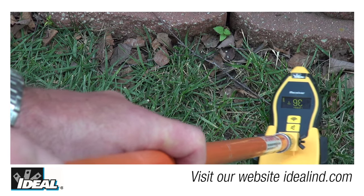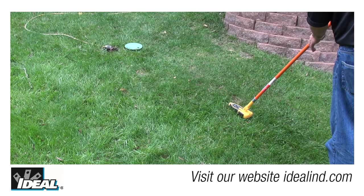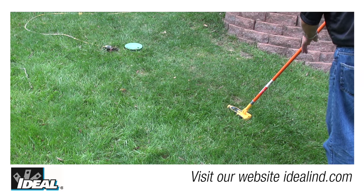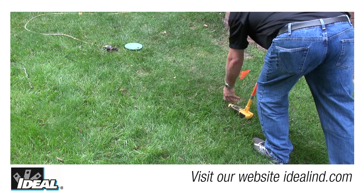By moving the receiver side to side as it is in line with the wire in the ground, you can pinpoint the location of the wire in the ground at the highest reading. Following these steps will help you trace wires buried underground.